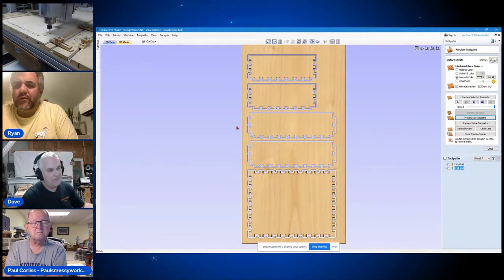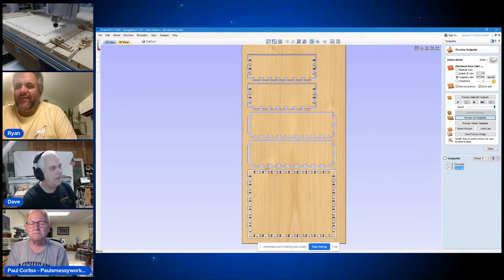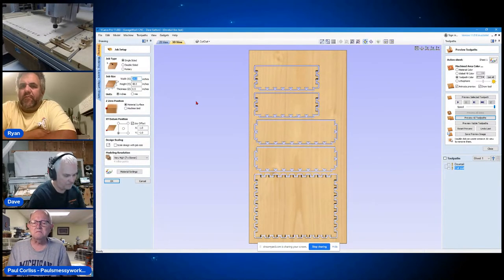When I set this up the first time, I had the material running the other way, 48 on the X and 24 on the Y, and it put this piece, this piece, this piece right where it is. It had this piece over here, which was okay, because that's still on the material, but it had this piece way up here, and it wasn't even on the material, and you couldn't move it. So, for example, if I come back here and I change this,